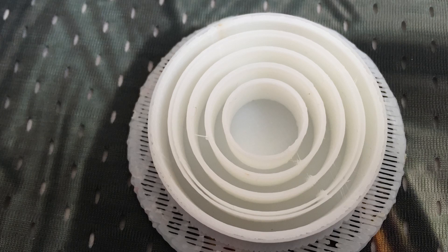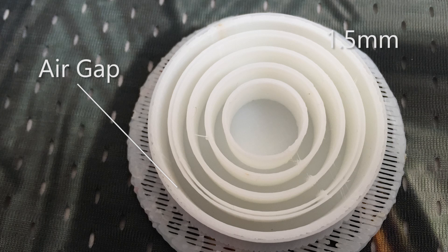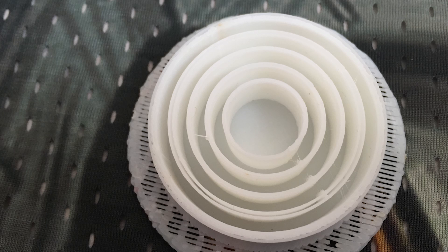So I printed this initially on the UP Mini on version 2.17 to try to replicate what they were having. The print turned out pretty good. However, as I suspected, one of the thicknesses did have no fill in between. And to my surprise it was the 1.5mm, not the 1mm, which had this gap in the middle. That must be because if it were to do a fill, it would actually make it bigger than 1.5mm, so the software chooses to ignore that fill and just print with air in the middle — not very strong, but it might be more accurate. I was actually quite surprised that it did the 1mm and 0.8mm quite well, but it completely ignored the 0.4mm. It did do the 0.6mm, but at these scales the tolerances are going to be pretty bad.